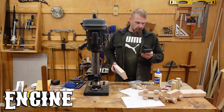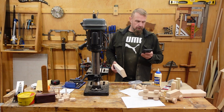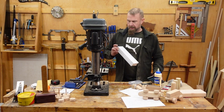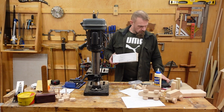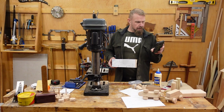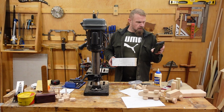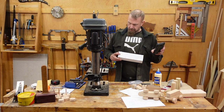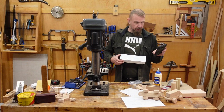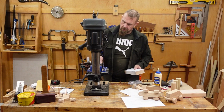On to the engine. The engine is constructed in a fashion similar to the cargo cars — the below instructions highlight special concerns for the engine. Begin by adhering the engine templates to the side and bottom of a 2x4 by 10-inch piece. Make sure that the point is on the same end. Secure the 2x4 in the drill press and drill all the holes — you may want to use a backer board. That needs to say 'must' again. I list the holes with the note of making the big hole last so there's no tear-out for the coupler hole on the bottom.